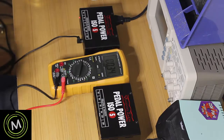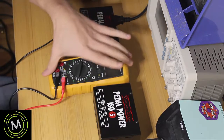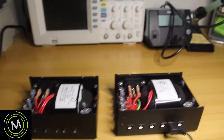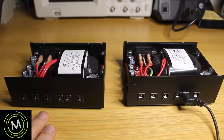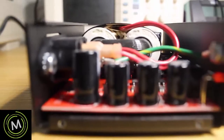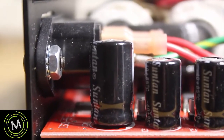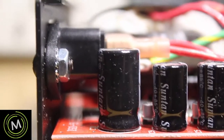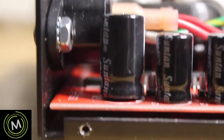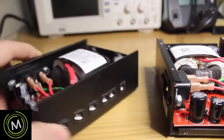The unit that is working is on the right; the one that is not working is on the left. The first thing I noticed was that this capacitor over here looks a little bloated from the side. If we look at the other unit, it's much more flat on the top - this one is a bit more bloated. That's something to look for if you're looking for capacitors to replace in your units. I don't know if that directly affects my issue, but it's a good learning opportunity.